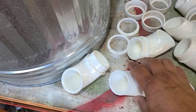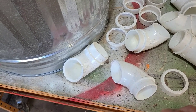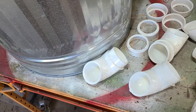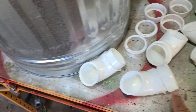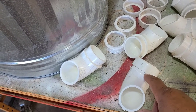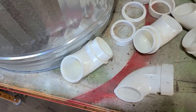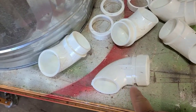The piece that we cut off of this side — the street elbow has a male end on one end and a female on the other side, that's why they call it a street elbow. So you take the female end that you cut off of this side, and that is going to be the coupler you use to fasten this connector in the hole. We're just taking it from this side and using it on this side. If you can't find street elbows but you can find ones with a male end, just get a coupler and cut a piece off to use for this.